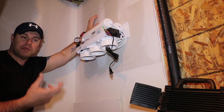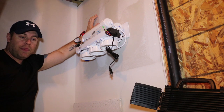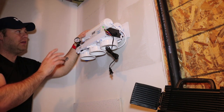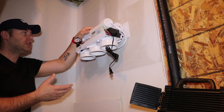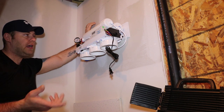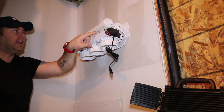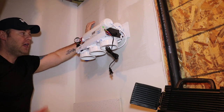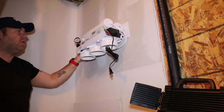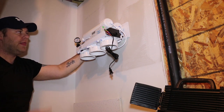You don't have to go buy a separate solenoid — this one is built right into the system. A couple other good features as well. With this computer, as soon as the brute gets filled up and it's full of water, it'll do a back flush right away and clean out your system. Because when you have all these filters and membranes — when they're like 100 bucks or whatever — you want to make sure they last as long as possible. That back flush cleans out the whole system. So that'll be your reservoir full, that light will come on, it'll turn green when it's good to go, and then the flush will turn like an orangey-yellow, letting you know when it's flushing the system. And like I said, it's got the booster pump built in — when I had my other system, it cost me almost $100 to install it separately, and it doesn't look as nice and sleek as this system.